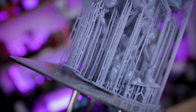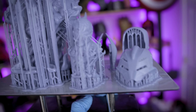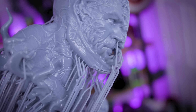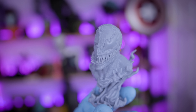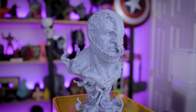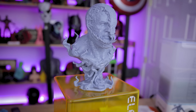One of the back corners ended up lifting away from the build plate, which just means I probably need to go back and re-level that build plate. And I have a few areas where it looks like air pockets got caught in there, or I just didn't have it properly supported — like here under the chin. I'm seeing the same exact issue on the same file on the smaller version of that Venom bust — right under the chin there's a little layer separation — but overall print quality looks so dang good off of this machine.